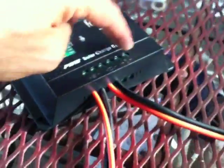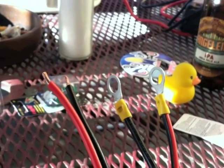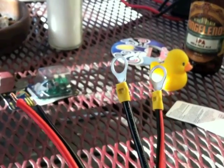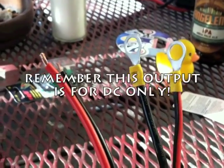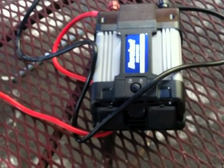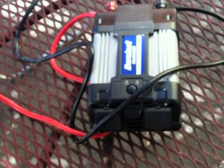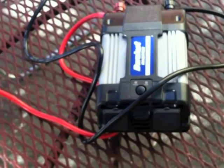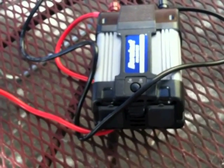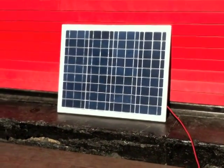Now we are going to wire from the controller out to the radio. There are a number of ways to get the power out — this is one of them; the other is using the inverter. The inverter is easy — it's got a built-in breaker — and that's probably the easiest option, but it gives off RF noise. So I won't be using that for my radio; I'll just use it for anything else that needs AC. We'll hook this up and should be ready to go.